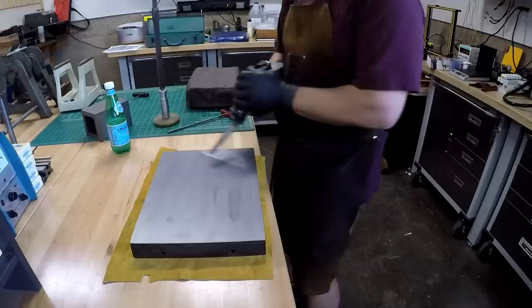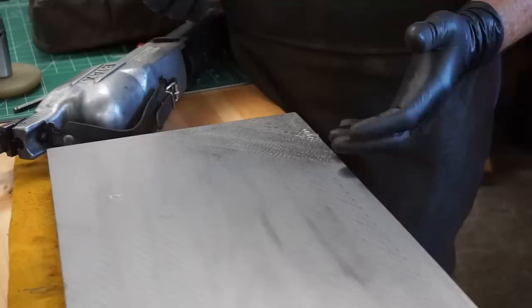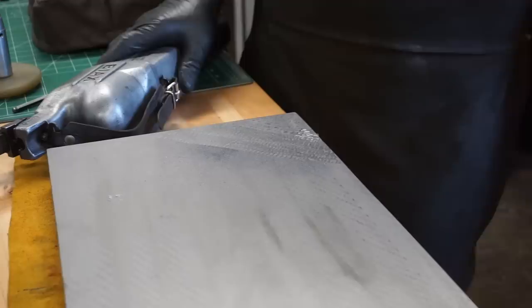In this last pass, I did a pretty good job of equally spacing my cuts to my blanks. But if you notice, you can get 5 times the amount of work done in the same time with a power scraper. I might have the stroke length on this a little bit over half an inch, plus or minus. And it really makes for short work of your scraping.